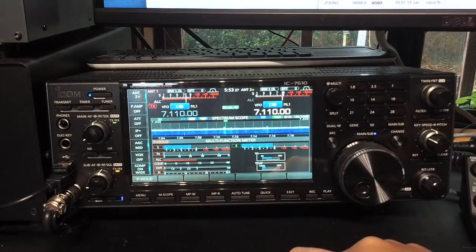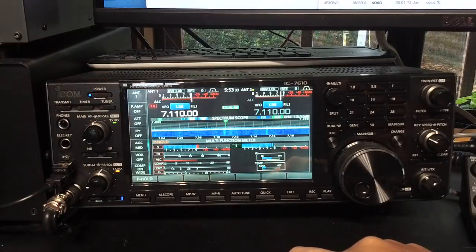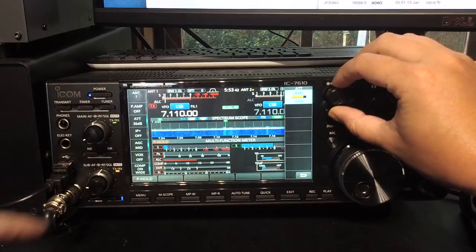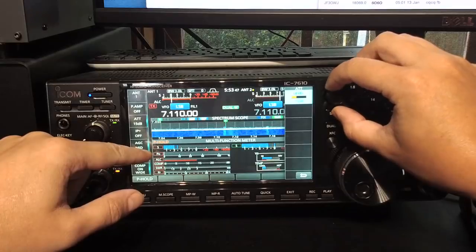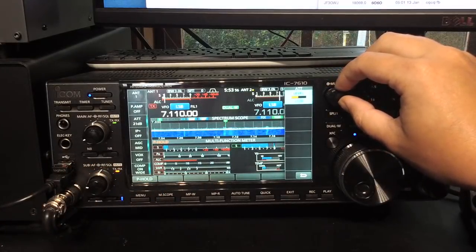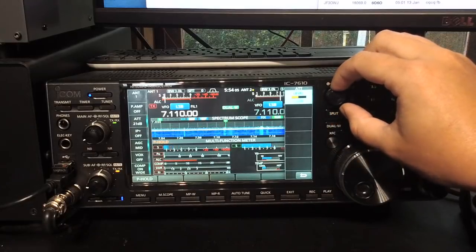And you can just tap it to turn it off. I really do like the fact you can step it - it's really cool. You can see the S meter of the first receiver has gone right down, while the S meter of the second receiver stays where it is. So if you've got two antennas and you want to set them to the same sort of level for monitoring, so that one's not louder than the other by default, you can go and adjust your attenuation so your two antennas match up.